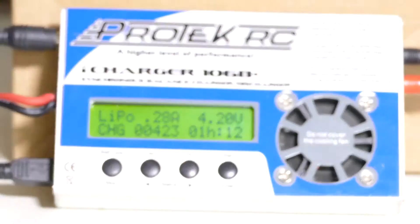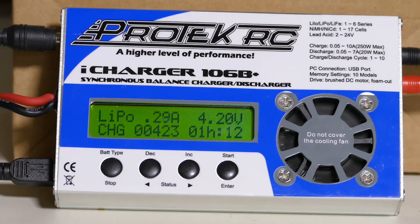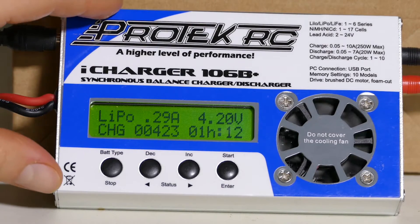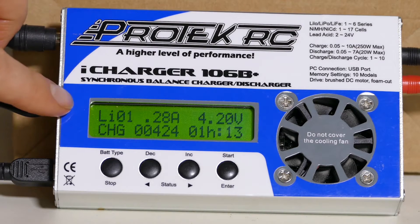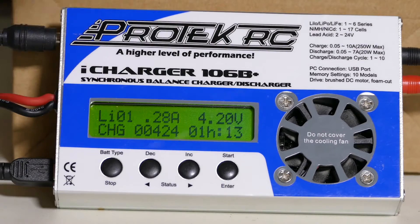So it's going to take another — I would guess probably about another hour, a little bit more. In this test so far it's actually started charging at a lower current, but we're going to see if it's actually going to be able to charge all the way to 4.2 volts, whereas the Tenergy was only able to charge it to 4.02.